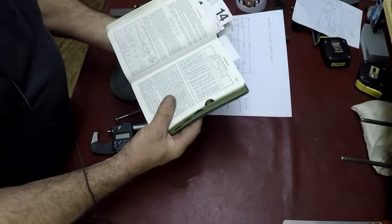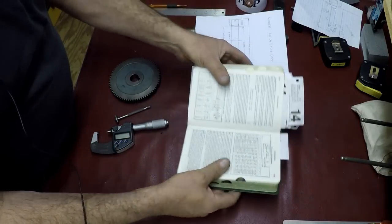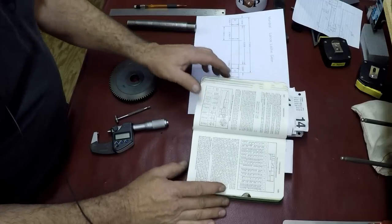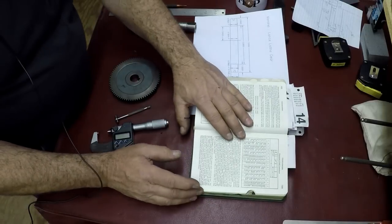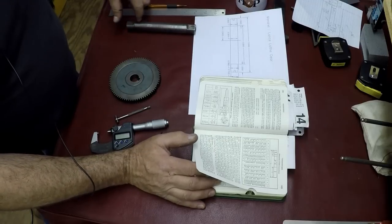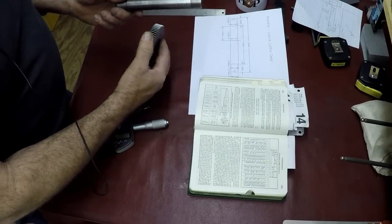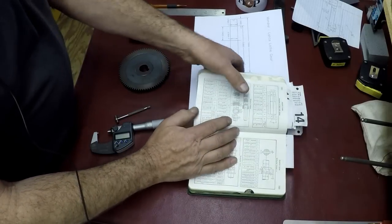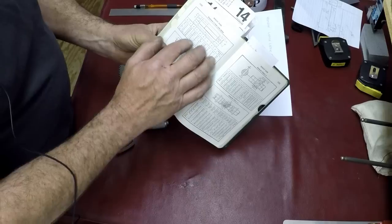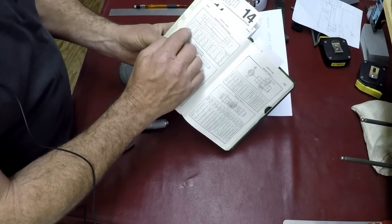So in this is a 17th edition Machinist Handbook. On page 1429, there's just a paragraph about lathe arbors in here, and they give you an idea of how they're measured out and the taper on one. I was concerned about what kind of taper is usually used, because that needs to slide on there and then get tight. So they have some measurements in here, this little table, about proportions of solid lathe arbors. So if you need to make one, you can get an idea, especially because here it only has certain ones listed: a quarter, half, one, one and a half, two, two and a half.